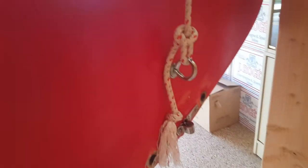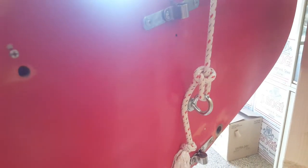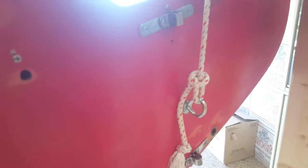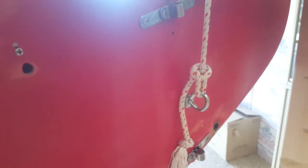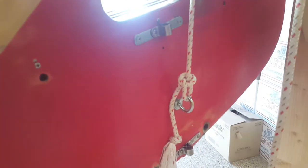I put an eye bolt through. This one's got the full solid wood transom, so if you were to do this with a fiberglass or partial wood transom, you'd probably want to use a 2x4 with a couple of bolts in there. This bolt I'll take out later — I'll just fill it up with some fairing compound and paint it.